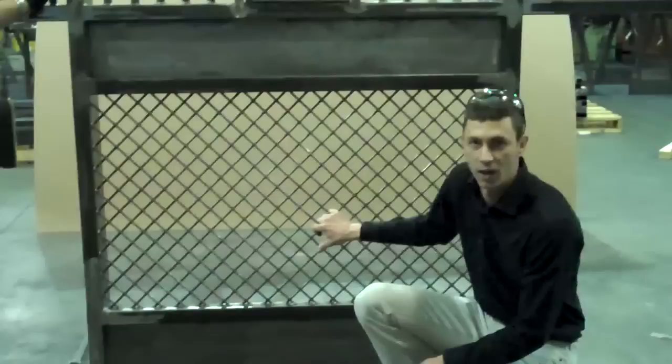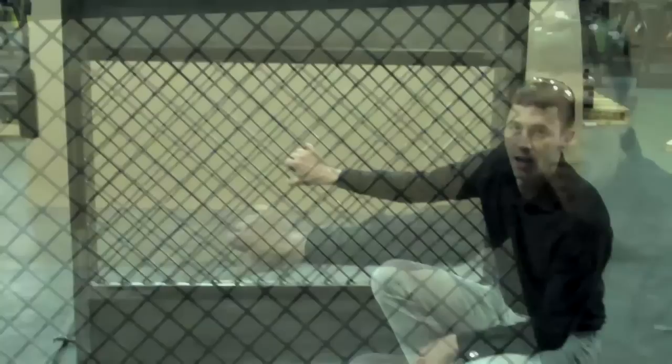With four shots from the sledgehammer, it didn't break apart. It stayed together, and the horse was still held within. After four shots with the sledgehammer, this crosshatch held up exactly the way it's supposed to. Being welded at every joint and around the perimeter, the bars held together and took the blow perfectly.